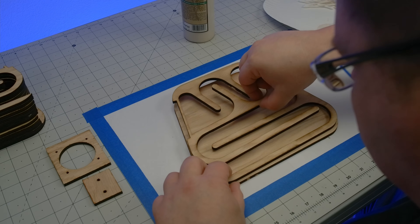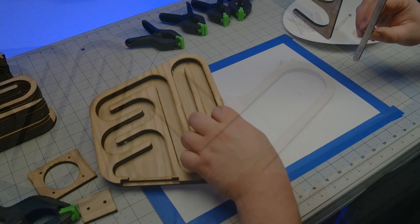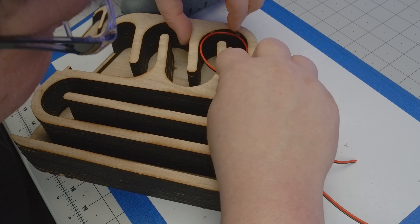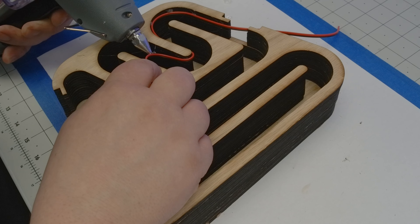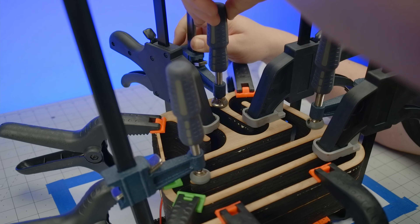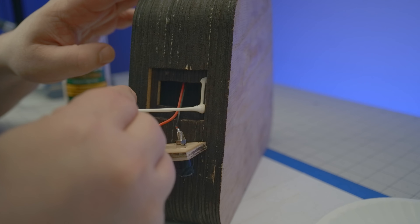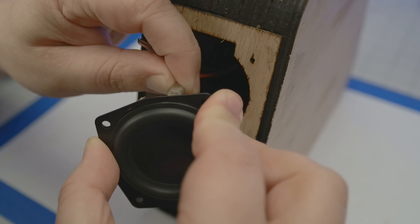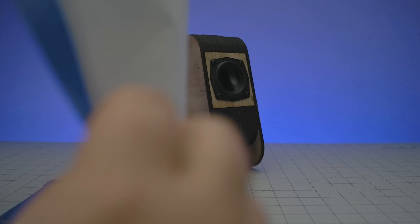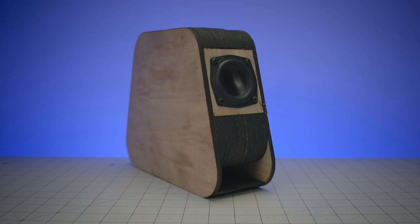Once all the pieces are cut, we can start getting the puzzle together, and this is just a casual glue-and-clamp type operation. You'll notice that I haven't sanded or otherwise treated any of the cuts, merely to illustrate what can be done with the laser and the laser alone. We press on until we come to layer 8, which brings us just past the halfway point. This is where I run the speaker wire, with hot glue as my preferred adhesive. From there, it's pretty much the same story until the last couple of layers where the ratchet bars replace all but the largest of my clamps. Once the final layer is in place, all that remains is to attach the binding posts, trim the leads, wire them in, glue in the terminal plate, and do the same for the mounting ring along the front. The last thing to go in is the driver, and thankfully these little Dayton units come with a nice foam gasket to ensure a good seal without the need for blue tack.